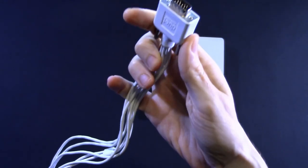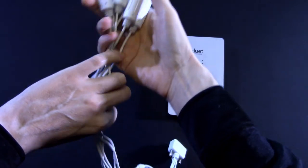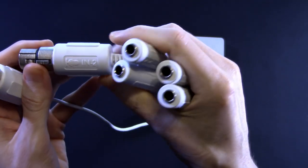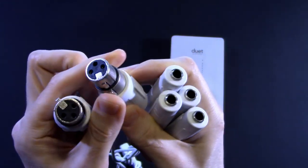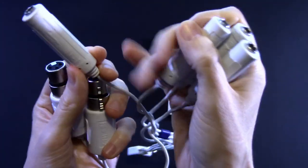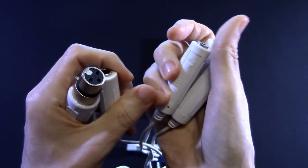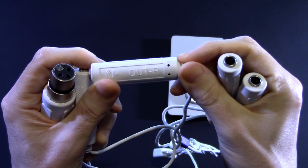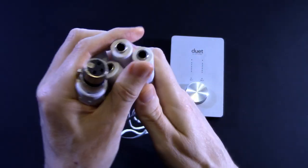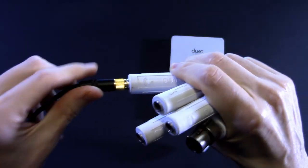So how do you connect anything to this? With this — the not-VGA cable, the breakout. There's a lot of breaking out to be done. We have not one but two full-size XLR connectors — cleverly disguised by the microphone signal, but they do lock. We have two line ins and two line outs, a guitar input, and as you might have expected, speaker outputs — out left and out right. These are all quarter-inch and they click in very nicely, very tight.